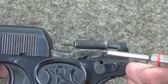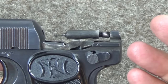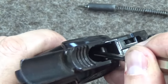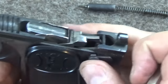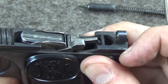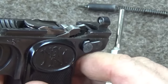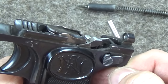There's not actually that much engagement there, but there are three different safety mechanisms that all have to be disengaged and the trigger has to be pulled in order for that to pop off. The three integral safeties are: the magazine safety, which needs to be depressed; the big mechanical gate safety here, which blocks the sear from moving; and then there's a tail on the sear there that also blocks it from moving. So we need the magazine in, we need this safety disengaged, and we need the grip safety pushed in, in order to drop the sear.